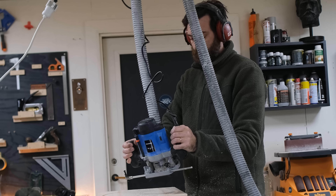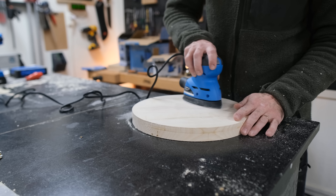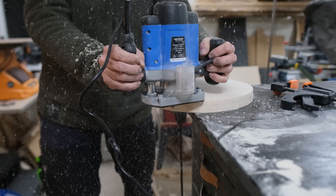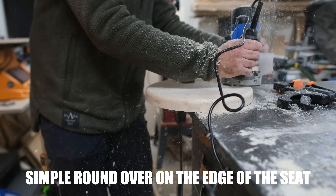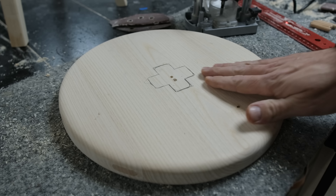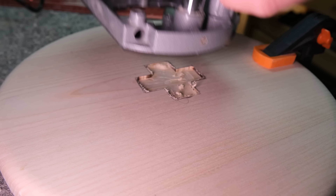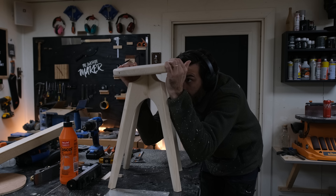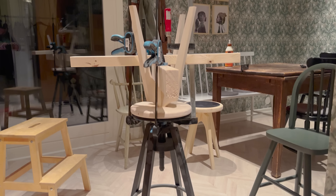I had one slip when cutting the circle where the guide jumped out of position — it didn't do any harm other than a small indentation in the seat. Then I sanded for ages with the sander, which was one of the tools I wasn't impressed with; it felt like nothing was happening. To attach the legs to the bottom of the seat I routed out a small pocket freehand for extra strength. I had to remove the dust collection guard to actually see what I was doing. It looked fairly good, and then I added two dowels ready for glue-up.